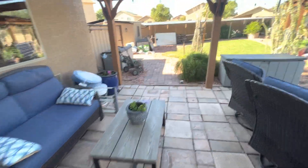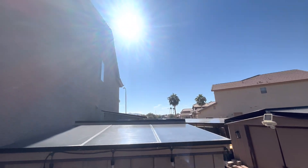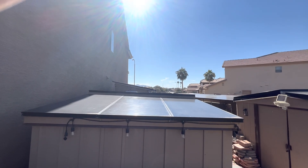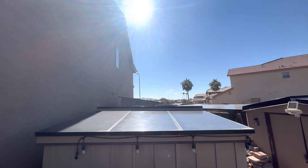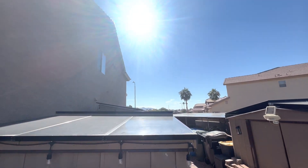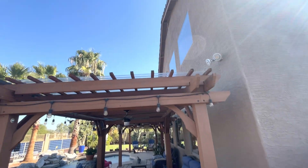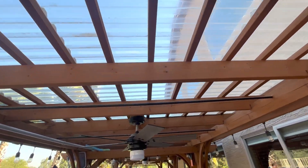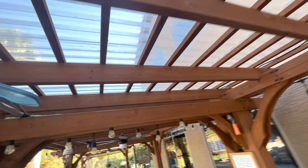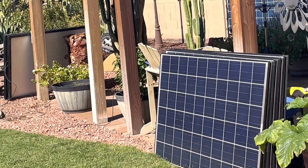Right now we're not running all of our panels — I think we're only running about 60 of these 250-watt panels. The sun is on the horizon — north is that way — and if you just go up a little bit it's maybe about 20 to 25 degrees up in the sky. But during the summer time that sun is all the way overhead, actually a little bit to the north, so we get quite a bit of sun all day long. We took all our panels off of here in the winter time; during the summer they'll get full sun all day. We still have another eight panels over here that are sitting there we still have to connect.